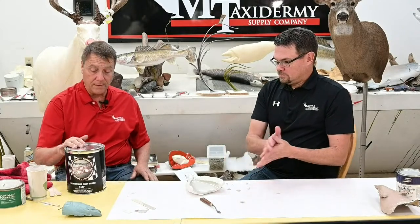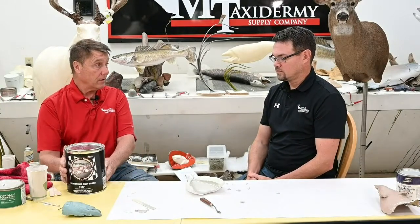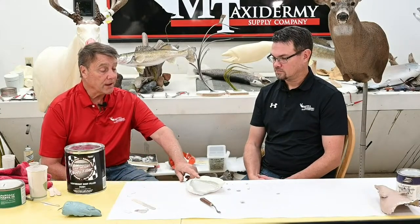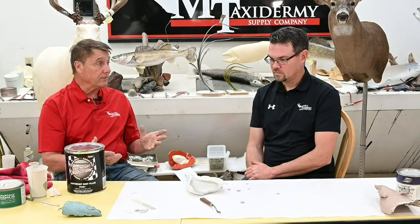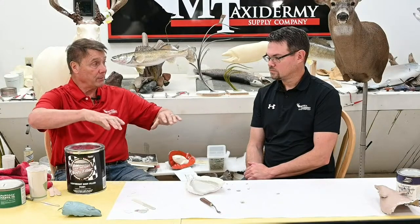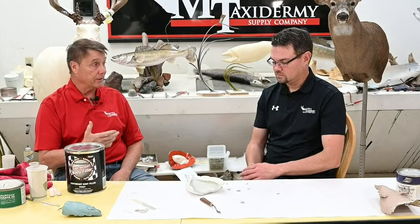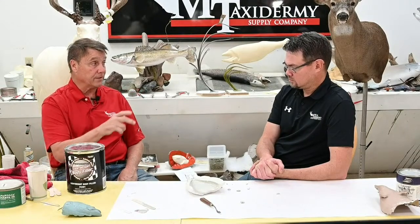Okay, now you fish people that want to attempt a fiberglass fish, a reproduction fish, in years past, before there was ever auto body putty and some of the other plastics, we used to make all of our reproduction fish out of plaster. So nothing changed in the process that we did. We would still lay the fish up in a bedding material. We'd pose him in something other than a reference material type pose. And we would pour a really nice coat of plaster, maybe 2 layers of plaster over him